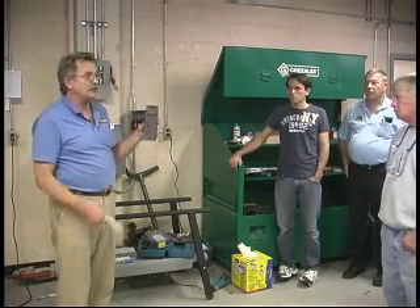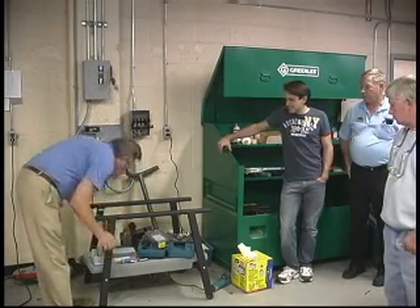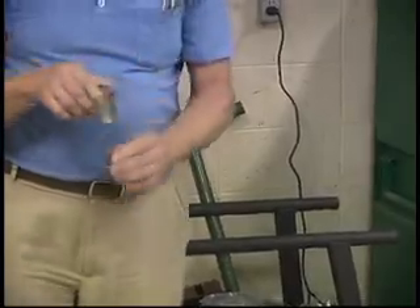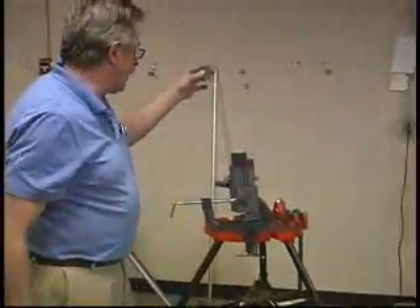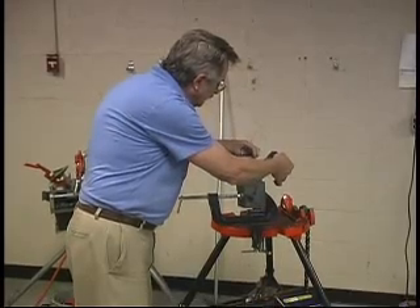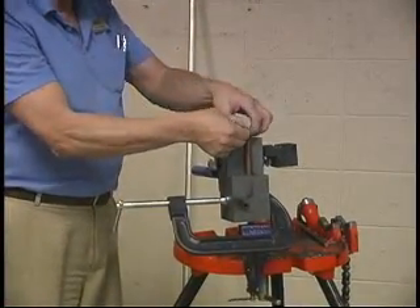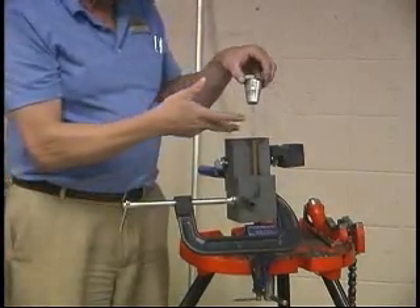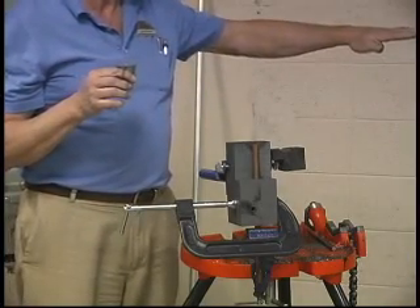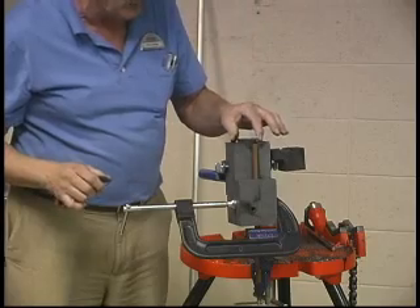You just shoot your igniter right into the mold — rapid fire, there's enough spark, it ignites and fires off. This particular one has a chamber at the top, so you want a little powder up here and a trail directly underneath it. Today we're using an electronic igniter, which makes the whole operation easier. We don't have to install the silver disc to keep the shot from pouring through before it's time — this container holds everything until we need it.